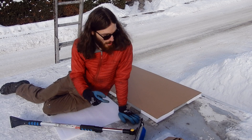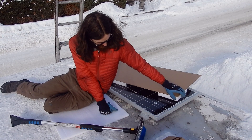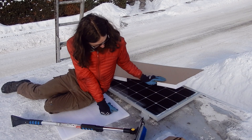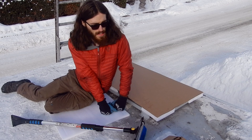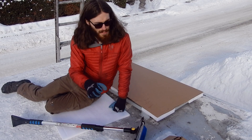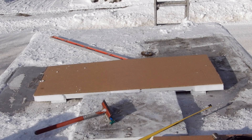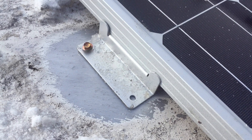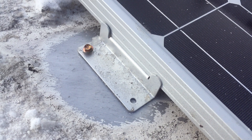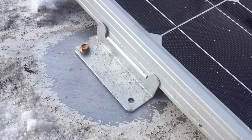I'm up on the roof of the van about to install this 100 watt monocrystalline solar panel from Renogy. I just need to find the exact right places to put screws in — eight screws total which screw this down to the roof of the step van. I've moved the solar panel and decided to place it in the middle horizontally so all eight screws can get a purchase on a structural beam, and it will be much easier to clean from the hatch in this position. I've ground away some paint and grime from the roof so I'm screwing directly into the metal, giving me a clean surface for siliconing later.